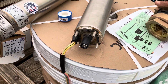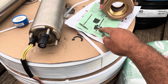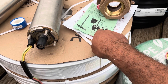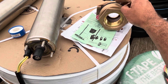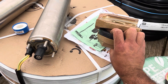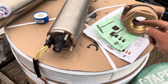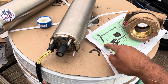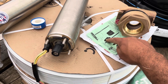This piece here goes on the inside of the well casing. So you got to drill a hole in your casing — this is your casing — drill a hole right here, and then it goes through. This lock nut fastens it all; it's got some rubber bushings here to seal it. And then this piece, which I'll put on the other end of the pipe — it slides in there. So this stays in the well casing, and then you would lower your line. Once your line's all in, it slides into those grooves and it's supported by this piece here.